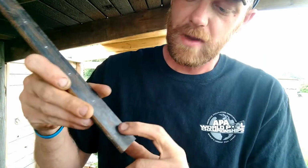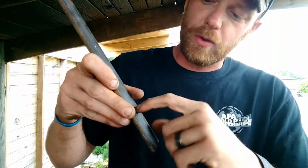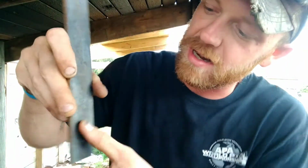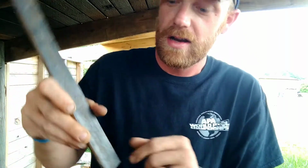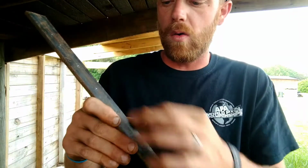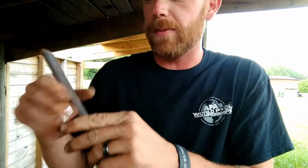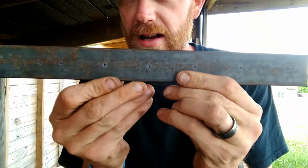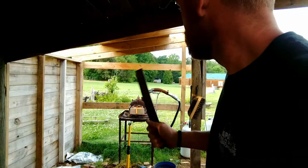We're going to clean this up. So they're all 2 inches apart, but halfway between this last set, we're going to put it in the vise and bend it 90 degrees, okay? And we're going to punch this hole out a little extra big. That way it'll freely move up and down through that hole to hook into these on our way up and down the trommel, okay? So that's what we've done. Set it out, center punched it, got it ready to go. And the forge is almost hot, ready to get in there and get started.